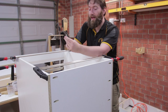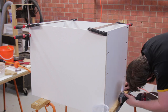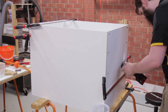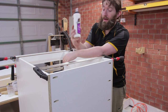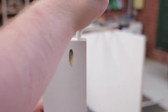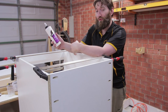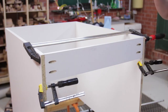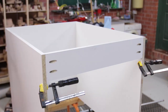Are we just screwing this together? Yes and no. You can get away with just using screws, and gluing it certainly isn't going to hurt. The downside to gluing is that it's more expensive and also makes these very permanent — you're not going to be able to unscrew the pieces and reuse them later. If you are going to use glue with melamine, you need to use a melamine glue. I've got Titebond's melamine glue — there are plenty of other brands, but this was easily purchasable online in a small quantity. It's white, dries clear, and adds a lot of strength. This type of glue is good for gluing melamine to a porous surface — so that would be the edges of the chipboard — onto the smooth melamine surface. Regular wood glue won't actually stick to the melamine face; it'll sort of stick to itself but is easy to peel off.